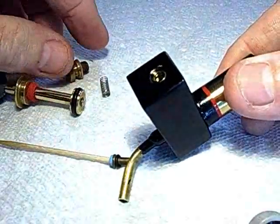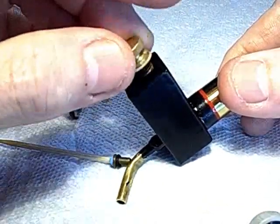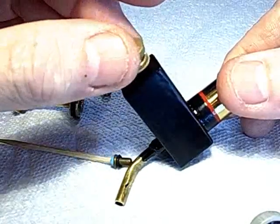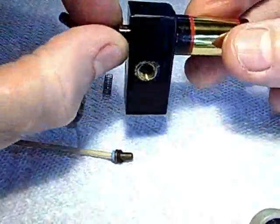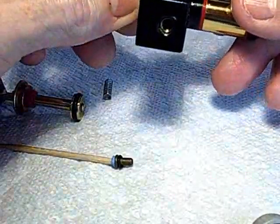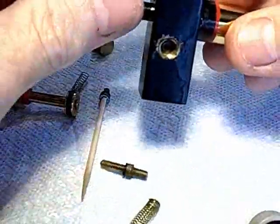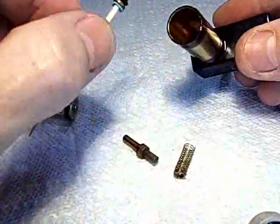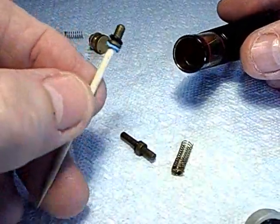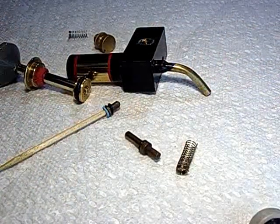And so that would go in there, and then you're going to put the cap on. All the cap does is seal, of course, and press on the spring. And you can adjust the spring. I can't do anything through the viewfinder. You can adjust the spring to have the right tension by adjusting its length. So I'll do all of the rest of the assembly off camera and then put this on the engine base. I see my new spring doesn't want to come out, but it'll come out. Oh, there we go. So you see, it's not so complicated. The only tough part about getting it back together is putting this little guy back in. There are better ways than this blue tack, I just haven't found them yet. Okay, those are the bits. Next I'll put the pump together off camera and see if it still works.